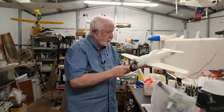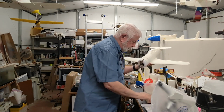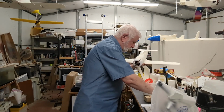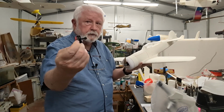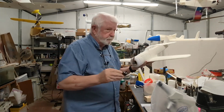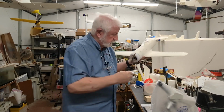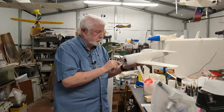Now, talk about the motor. Lewis recommends a couple of motors for this. This is the small one. It's a very small 2205 2300 kV motor. These are motors normally associated with quads, and they're cheap. Usually you can get them in packs of 4, although 2 of them will be running the wrong direction or have the wrong direction thread on the shafts, but that's a workaround. But anyway, they're cheap. A mount for the larger motor and the small one will be included.